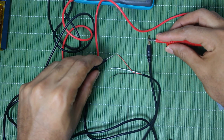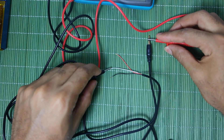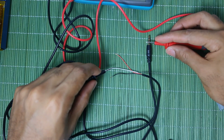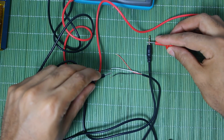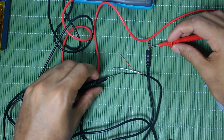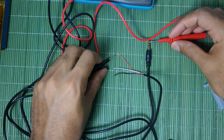This second one is the positive for the push to talk, or basically where the push to talk is going to go. So if I press this one, it should be this one. Now we're going to go to the ground. I'm sure that this is the ground because it's black in the cable. There you go — so that tells us that this is the ground. This is going to be the push to talk, and this is going to be the one for the microphone.